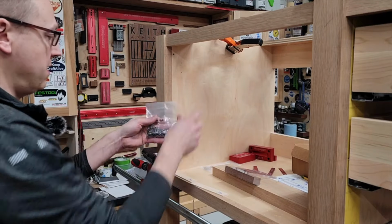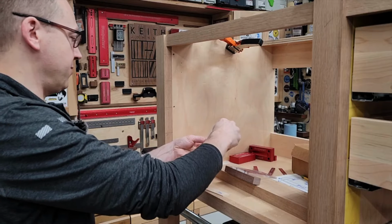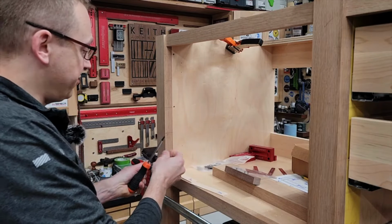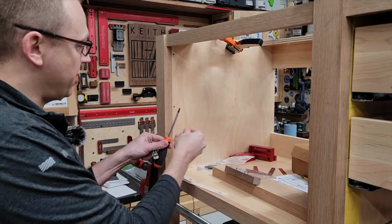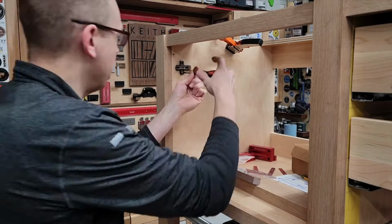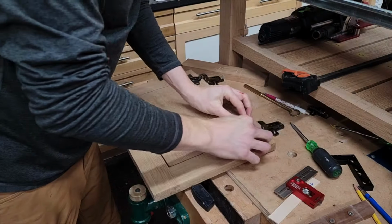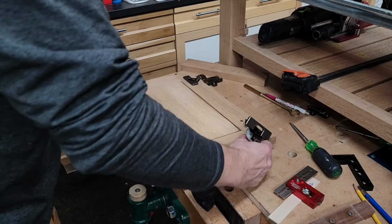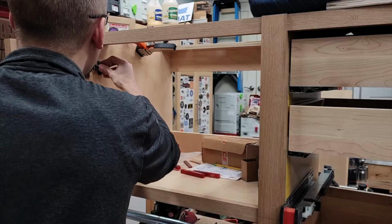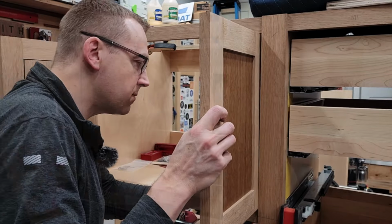So like I said, it takes a little longer to make this jig, but you saw how fast and accurate it was. And they also make these titanium screws, which pair nicely with the titanium mounting plates. Now these are Posidrive screws, so there's a special screwdriver. This is magnetic. Then I can just pop in my hinges and snap them down. Those expand the dowels in the holes for a nice tight fit without screws, and then mount the doors and see how the spacing looks.